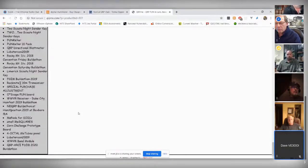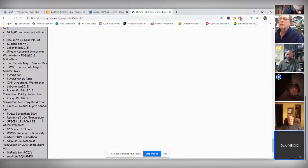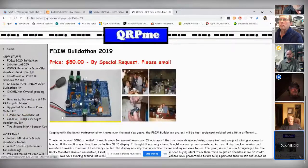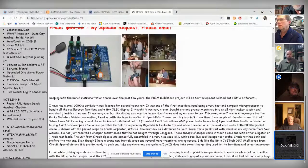Yeah, I agree. I think you just need a resonant LC circuit. I don't think they use full-sized antennas, because I have an RF field strength meter, but it's very compact. So they do some tricks there. They just take a coil and capacitor, or they keep it broadband. But that's the fun part to figure out, because I don't think it's hard to construct. It just takes a bit of trial and error to figure out what works.